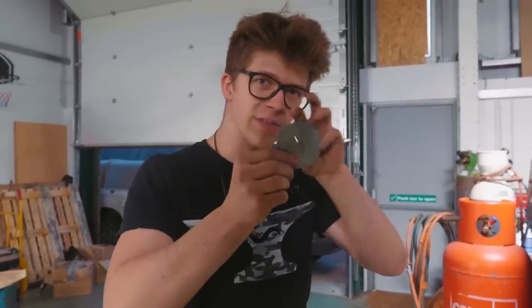There are a couple of different things you can do with wrought iron. You can etch it. You can, I've heard, as far as I understand, flame etch it. We're going to give that a try. I've tried it in the forge before and I didn't get the result that I want. We're going to try it with a torch, and worst comes to worst, it blackens it and gives it the beautiful scale black finish. Best comes to best, it oxidizes away the different layers respectively to a different extent and gives us a little bit of insight into the pattern of the wrought iron itself. So we're going to do that with the torch. Let's give it a go.